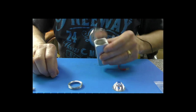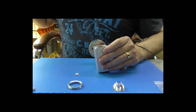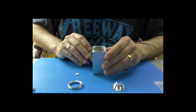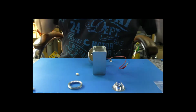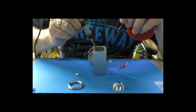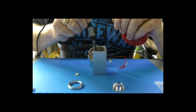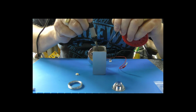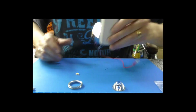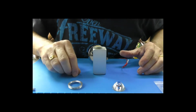Yeah, so it's just metal to metal, there's no heatsink compound on there, so we've got to make sure that this is pushed down when we're soldering it in place. I'm just going to apply a little drop of solder onto there. In fact, what I'm going to do is use the 300-degree solder. I'm sure it doesn't get anything like that, but we'll just mix some of the 300 in there. Okay, so that is that. Now the negative is facing that way, so let's grab the new one,